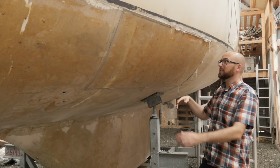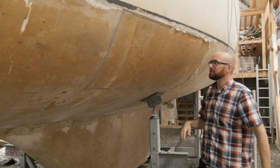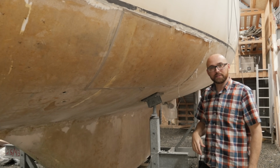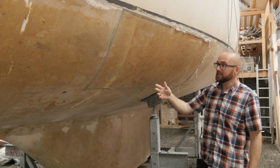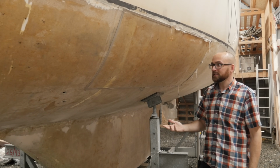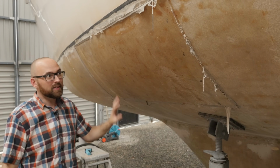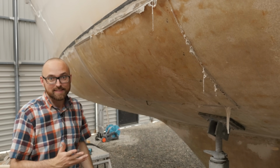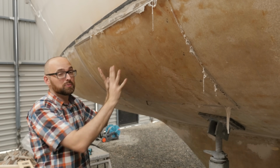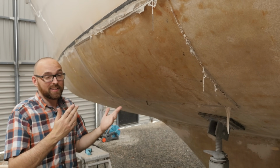And this is what the laminate looks like after a treatment. I had the mat on there for a little over 6 hours and the temperature was set at 93 degrees Celsius. As you can see, there has been a slight color change, but from what I've been able to read online, that is okay. This area was one of the areas with very high moisture readings. Now the laminate is still way too warm for me to measure the moisture levels, but I'll find out tomorrow if the treatment worked.